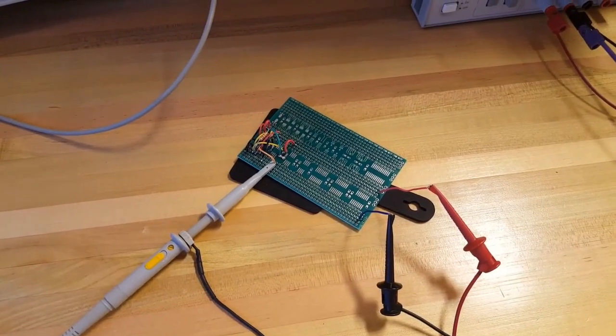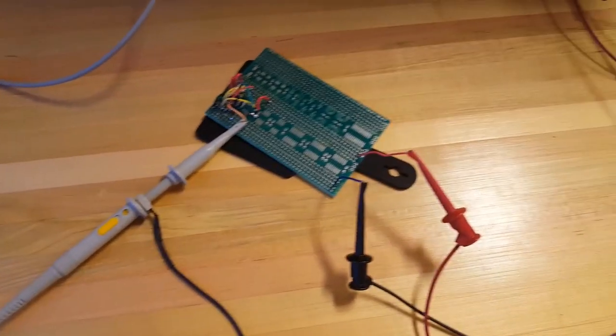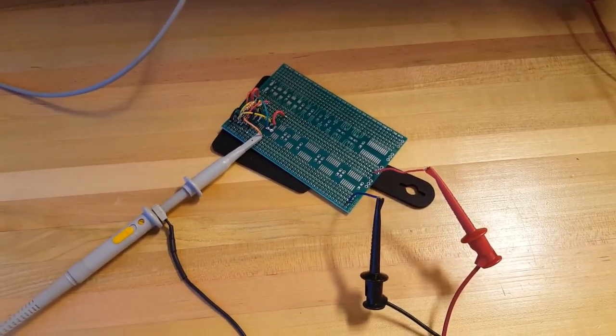We first implement the circuit to provide control for our converter. We're using a 555 timer, shown here under this mess of wires. The 555 is apparently the most popular integrated circuit ever sold, and it's easy to understand why. With simple RC feedback, you can produce pretty much any frequency and duty cycle you could want.